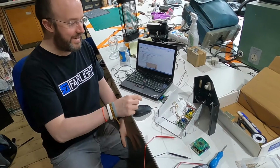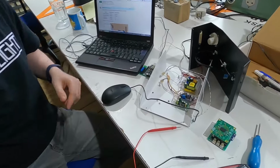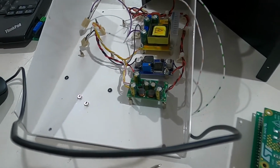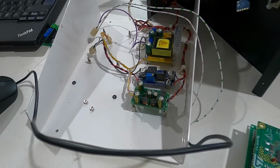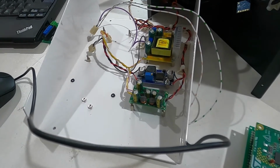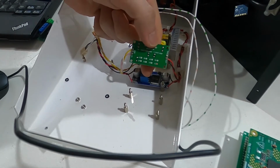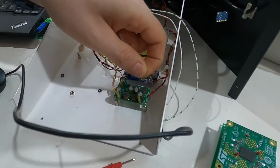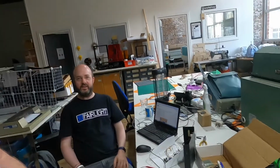So it turned out after unscrewing the wires that this one had a short. This module, this plus minus 12 volt module, but it didn't seem to have the short when it was taken off the standoffs. So it looks like it might have been shorting together, and the joys of a nice metal case that's connecting everything together.